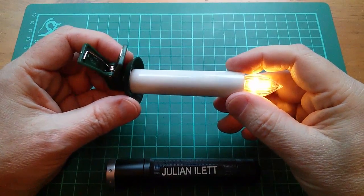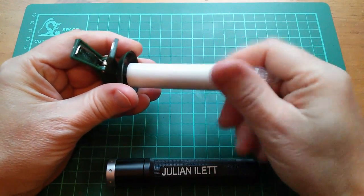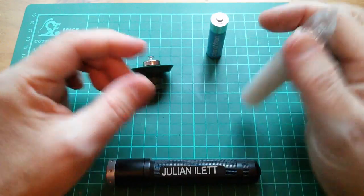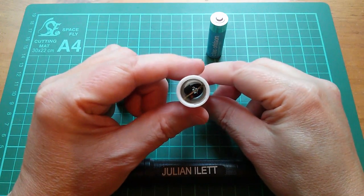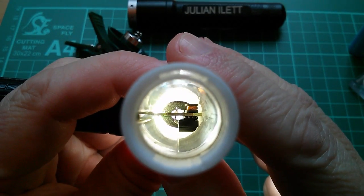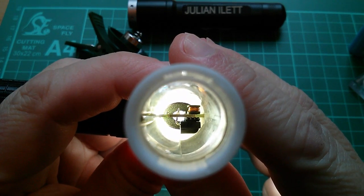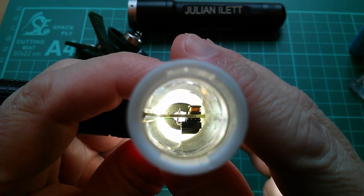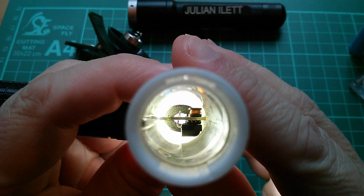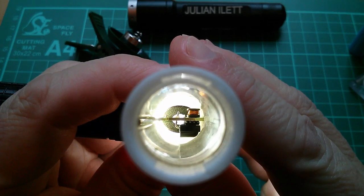Let's have a look at one of these candles. If I unscrew the body of the candle from its base, this clip thing, you can see how the battery arrangement works. Up inside there you can make out that there's an infrared remote receiver — that's the black square thing at the bottom. Just underneath that, between it and the PCB, looks like there's an 8-pin chip. And then there's clearly an inductor on top of the board, so we've got a remote control receiver and probably a boost converter.